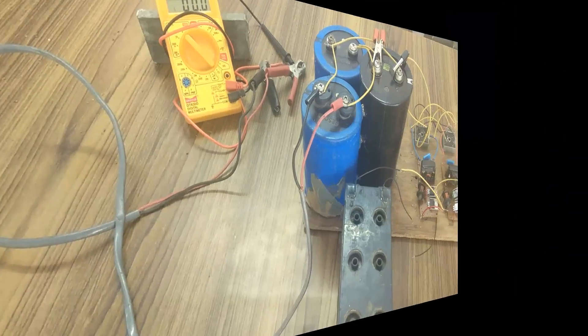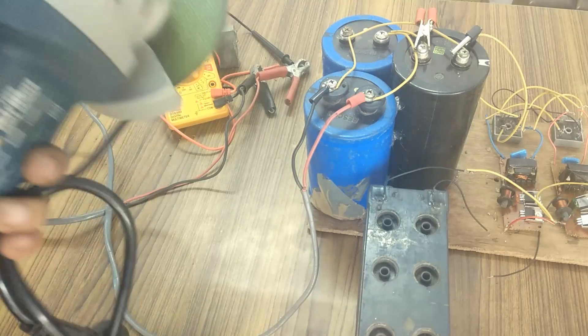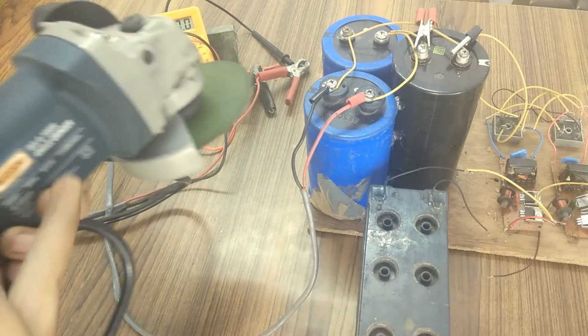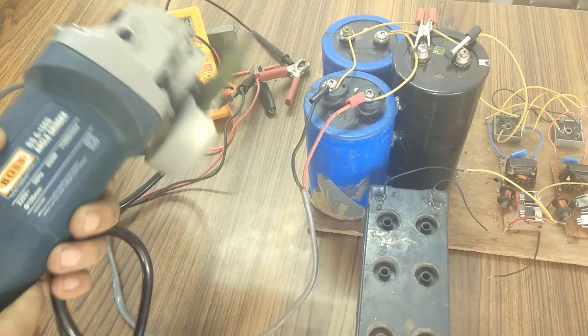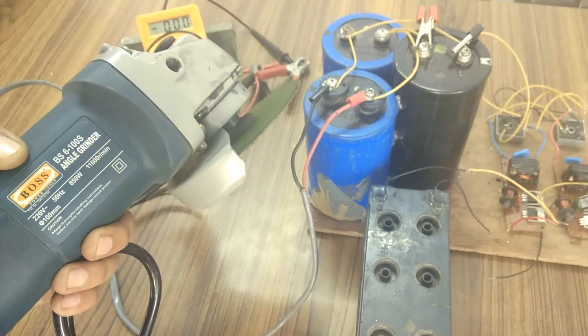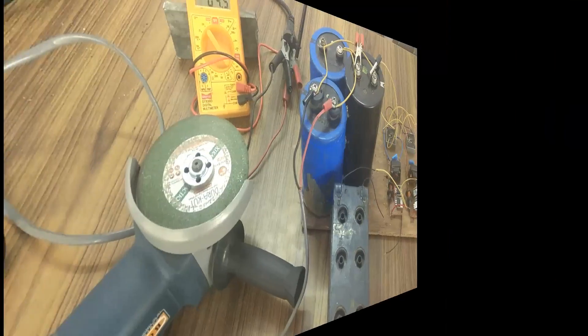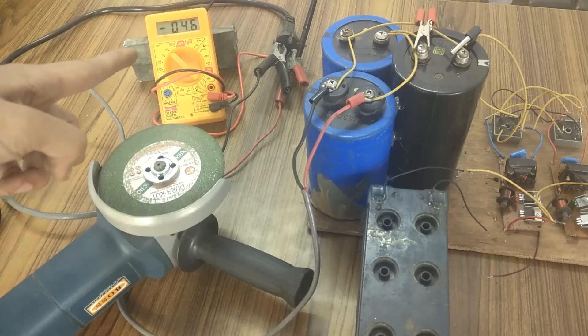The point of this circuit is to operate a drill machine rated 220 volts with just a 12 volt battery, inverter, and capacitor bank circuit. Before changing the appliance, you have to bring the charge indicator on the multimeter down to zero, because the capacitor bank is still charged — it is showing 97 volts even though the battery is not connected. I will free-run the drill until the voltage comes to 0 volts.